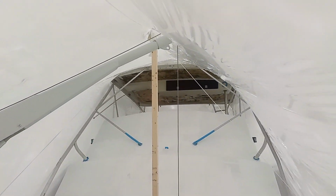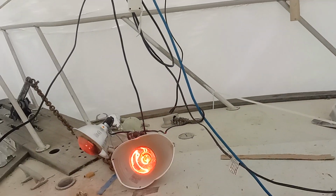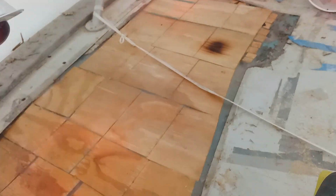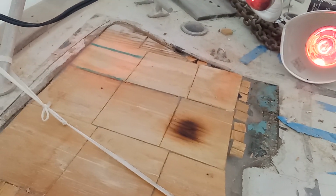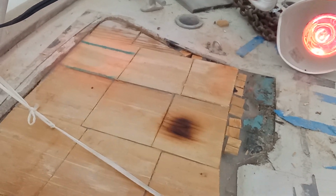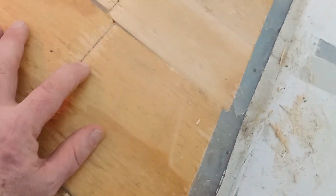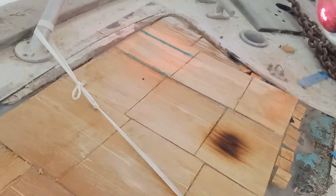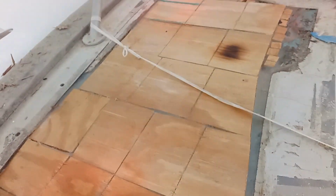I am back on this 55-foot ocean. This particular ocean's got this nice hole in the deck. It's all nice and dry now. It's been recored. Nice solid fiber underneath, and some fiber and Cabosil mix to bond these wood pieces in place.